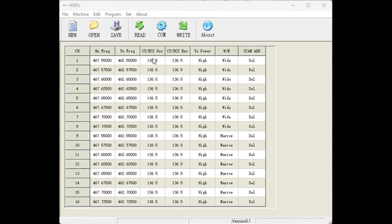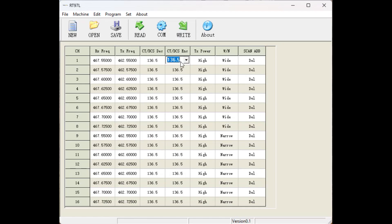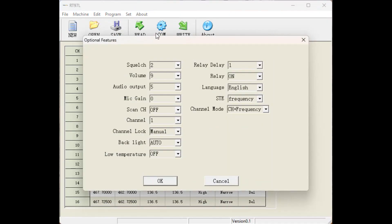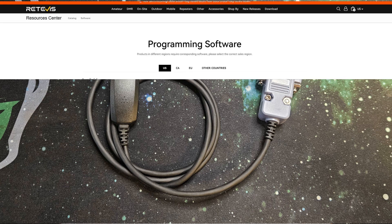This is the very basic and easy-to-use programming software. You can go in here and set CTCSS tones or digital tones — in, out, cross, anything you want — and it's right there, simple to use. There are also some other options in here for some of the other features that this thing has: squelch volume, the backlight, and that low temperature setting can be turned on or off inside of this software as well. The repeater comes with the programming cable you need, and the software is free and available on Retevis's website.